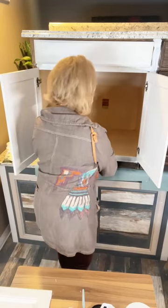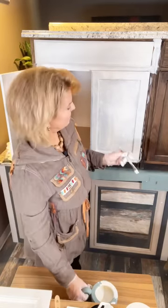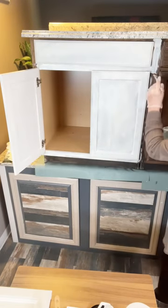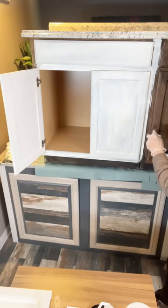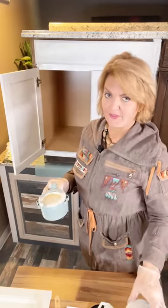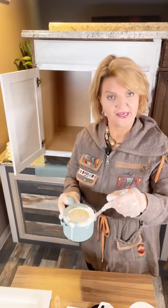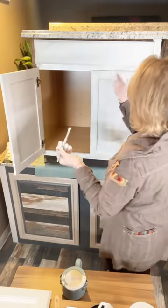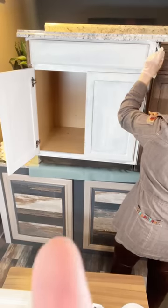We're pretty dry here, so let's start coat two. They're confused because I did swipe and stipple on one door and brush and roll on the other. I'm trying to show you both. You can do brush and roll on the first and second coat, or you can do the true applicator where I just swiped it on there.